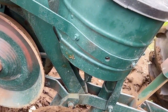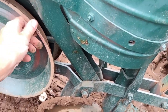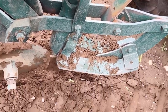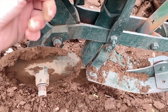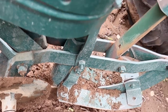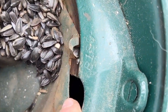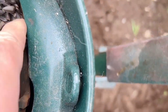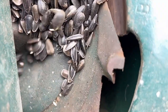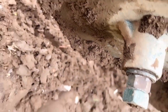This right here is your disc opener. And then this right here is your fertilizer hopper — I didn't put any fertilizer in for sunflowers — and then this is my sunflower seed. What happens is this packing wheel turns, and when the wheel turns it turns the shaft here, which turns another cog there, and then it drops the sunflowers out. They catch in here, come up on this gear, and drop down underneath.